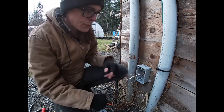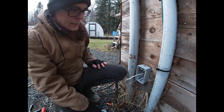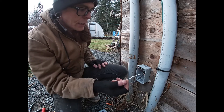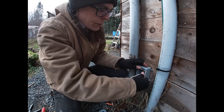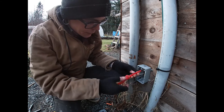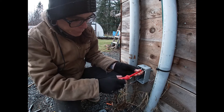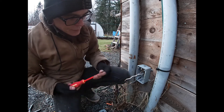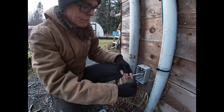Got about six inches coming out to play with, so I'm not gonna be stressing too much about lengths. We are going to take our ground wire, which is this bare copper wire, and it is going to wrap around this green ground screw, and that just holds in place by screwing it down like that. Great, no problem — sometimes that is a problem, but it wasn't today.